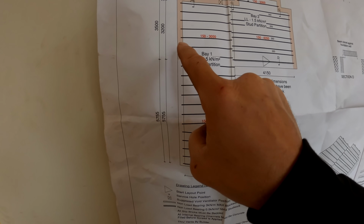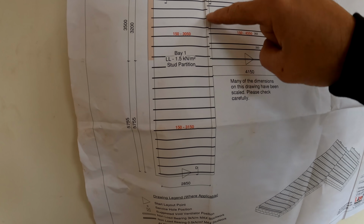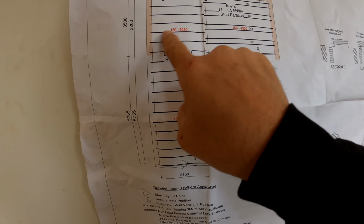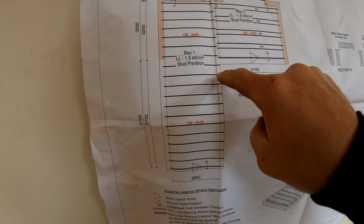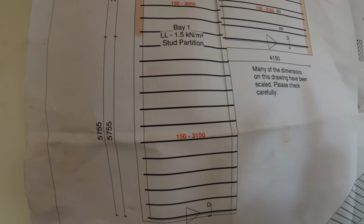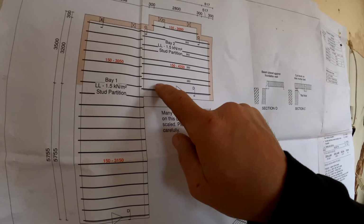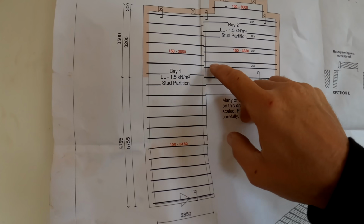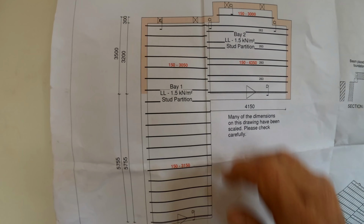The reason being is that this is a 9-inch wall and that's a 300mm wall, so obviously the two differences. And then we've got blockwork laying flat here to take the relevant length that we want. So what will happen is that we know that the centres are 490 from beam to beam to beam to beam to beam. Now remember me saying to you about some block and beams getting laid lengthways or widthways, and this is a great example because these beams are quite long. So basically that's the length of the block and then the width of the block, length of the block, width of the block, and that's what we'll do.